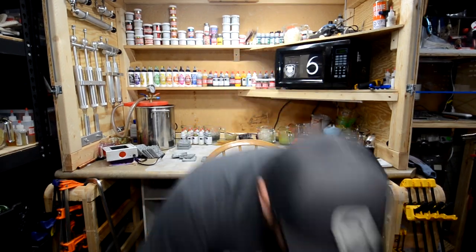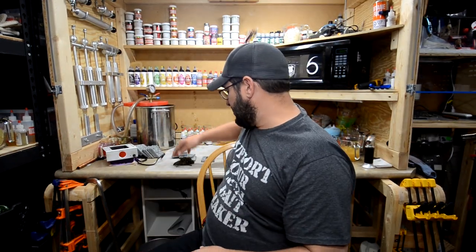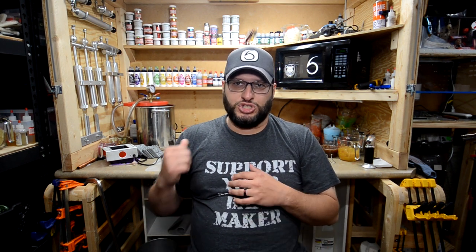And I got thinking, I bet some of these little bugs would be great for throwing around on a fly rod or trout fishing or something like that. I think it would be really awesome to do a bunch of these for that. But again, it's just pouring them precisely, high heat. I may try to heat the molds up next time when we do part two, just to see if it helps get into those little appendages. I bet it will, but it's very difficult to pour all those little appendages and then have to trim them afterwards. Kind of a pain in the butt. So injection would be much better suited for these little bugs and stuff like that. But how cool was that?